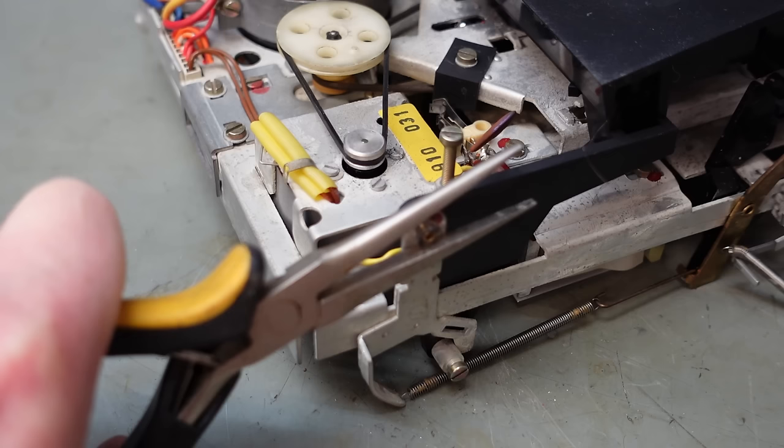There's something wrong with it. Just eject the tape, and run the motor again. Well, that's running really freely on its own. And with the tray shut, yeah, still 0.15 amps. No trouble. This one's quite tight, but that's because the brake's on. If I just push that forwards, lifting the brake, that's loosening it up. It's not making a lot of difference to the motor current on this one, though.